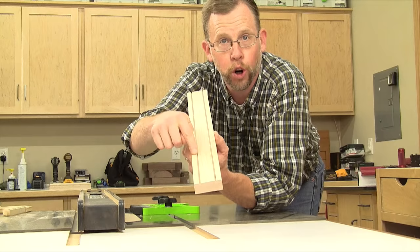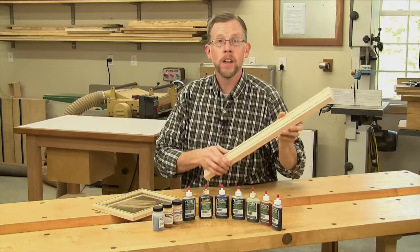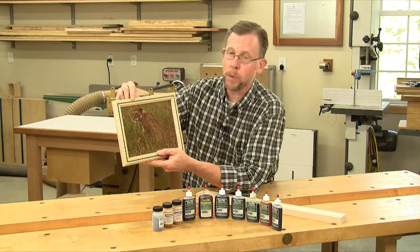I've also cut two grooves here because I'm ganging all four pieces of my picture frame from one piece of stock — an end and a side of the frame, plus another end and a side. The cool thing about this inlay technique is that wood dyes like this come in lots of different colors — all the primary colors and more — so you can pretty much make your picture frame's pinstripe any color you like.